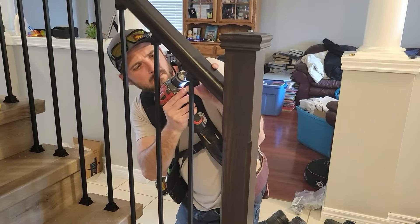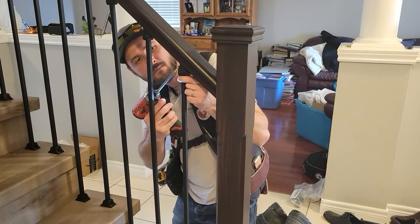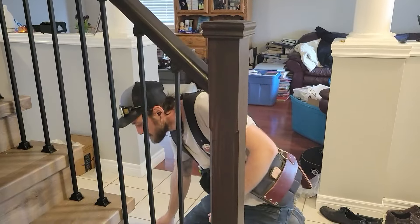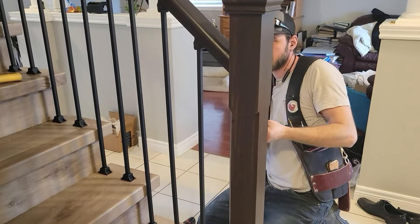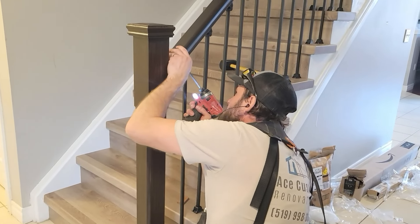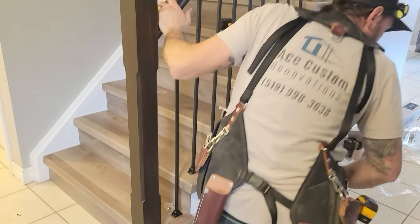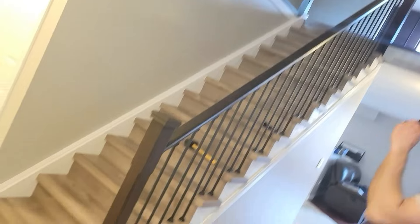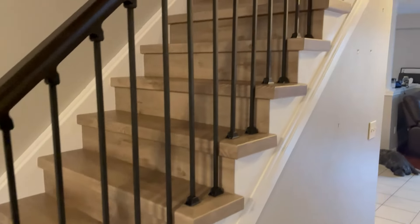When you're redoing other stairs there's always that slight variation — nothing is perfect. So it's really hard to work with those prefab ones where you just don't have those options and don't have that wiggle room. I did mention on the installation at the top that we're always pre-drilling our screws because we don't want cracking, but especially when you are installing down right onto a vinyl stair nosing like in this case, you definitely need to be doing that drilling or else the vinyl will crack. For this particular job we did refinish the stairs — this is vinyl that's on the stairs. Here at Step Up we make these vinyl stair coverings for open stairs custom. We also make them for closed stairs out of all sorts of different types of vinyl, and we did lay the vinyl at the top of the stairs as well. Please check out our website, stepupvinyl.ca, hit that subscribe button and check out our other videos.